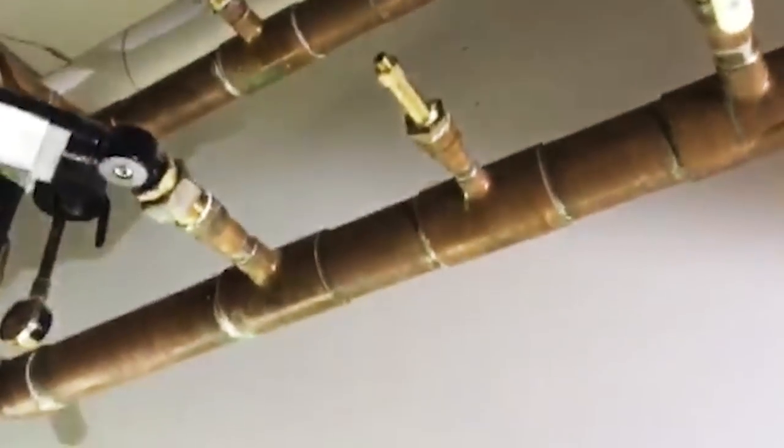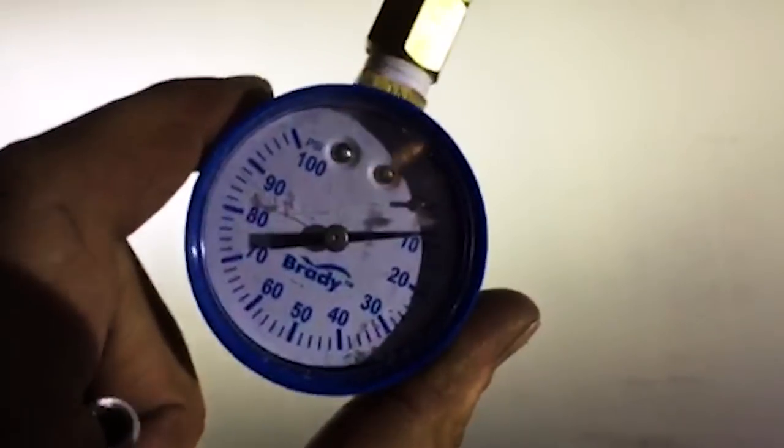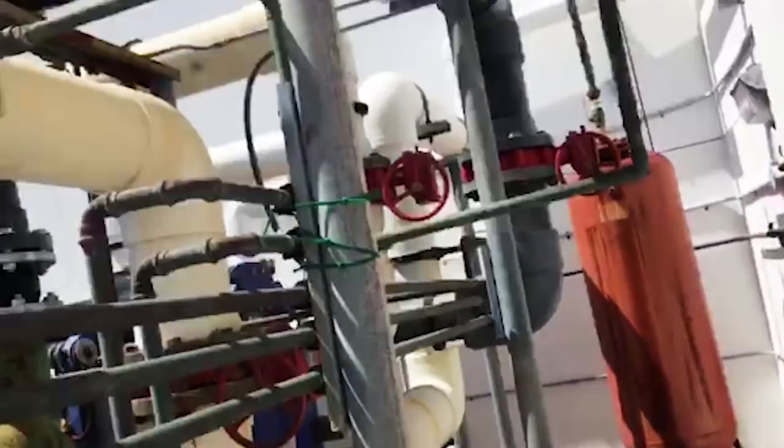I just changed the contactor on this chiller — waiting for it to come back on. There we go. I just wanted to do a quick example: if you're lucky enough to have a Pete's fitting — this is called a Pete's adapter, I got it off Amazon for about 20 bucks — it has a little port. I've got a pressure gauge on it now, though this isn't a great pressure gauge as an example. You can also stick an immersion type thermometer that's the same diameter in there. There are two sizes, and I've put it in a bunch of them just to play around with it. Not super critical to have, but it is nice to have, especially with a more accurate gauge. You can also put your chemicals in and feed them through back into the system.